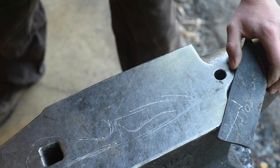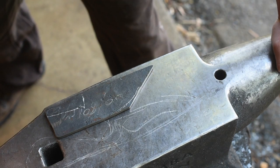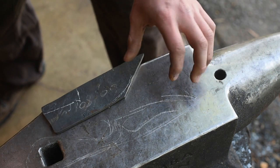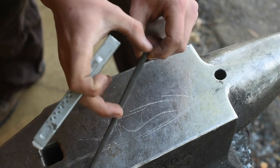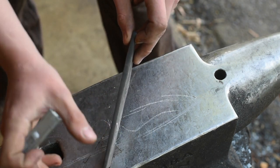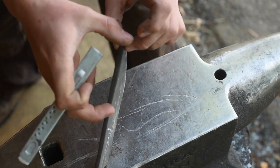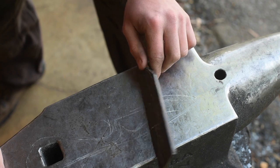There are bevels there. Something simple. Let's see if I can pull that out and see how that looks. I want to do as little forging as possible and I don't think I'm going to forge bevels because this is already distorted. This much of the billet is centered but in this part the core gets kind of really pushed off to the side. So I want to distort this as little as possible and hopefully not push it any farther off center.